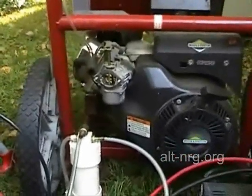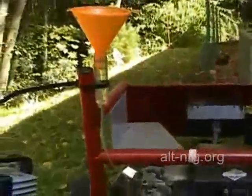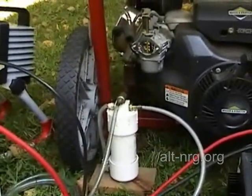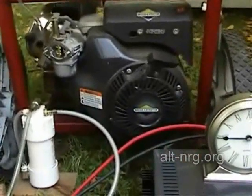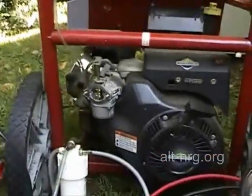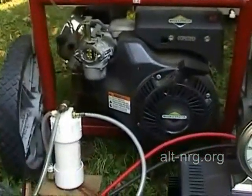The experiment is laid out this way: I'm going to take a measurement with the lamp connected to the output of the generator and measure the rate at which a fixed amount of gasoline is consumed. Then I'm going to inject HHO into the carburetor powered from AC coming from the house first, to see how it affects the rate of consumption. Then I'm going to connect the VS-50M to the AC outlet of the generator as an additional load, and if the rate of consumption is still less than it was without any HHO at all, I'll know there is a net gain in total system efficiency.